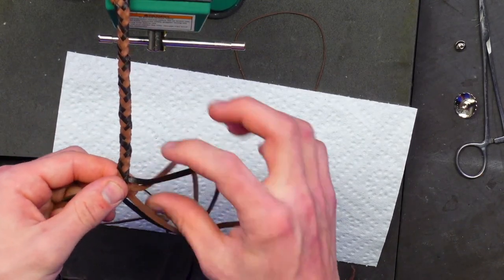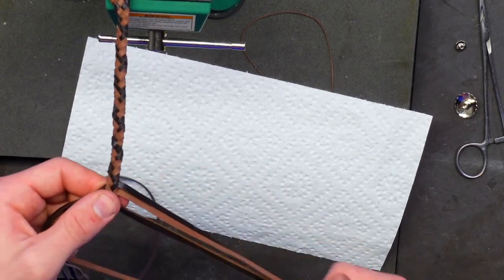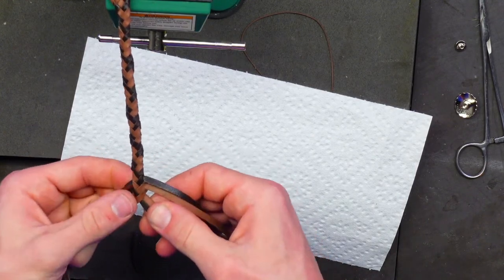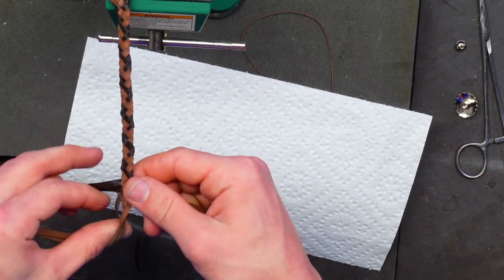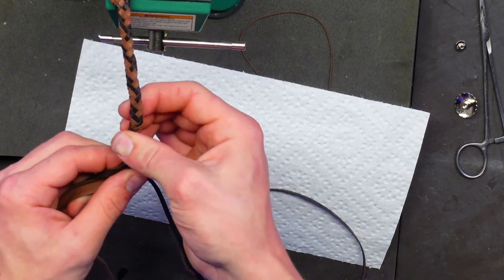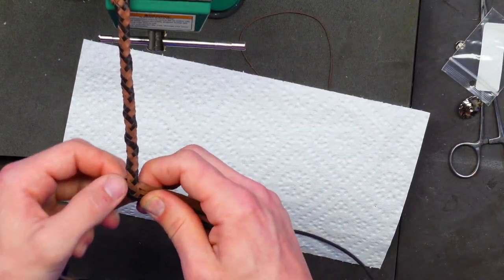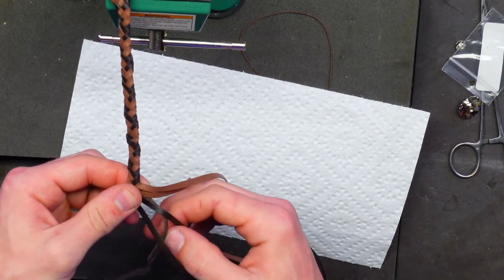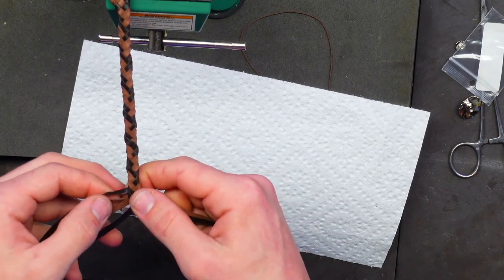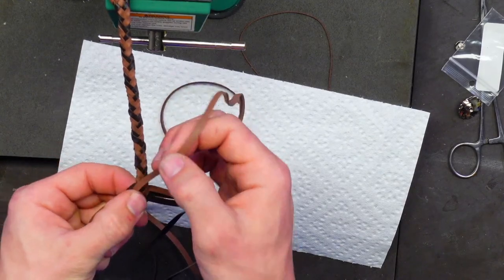When you use it as a resist, you can wipe it on a lot easier. It doesn't really make a big difference. But after you've got your resist on and you put your antique on, if you go over it with a wipe-on sealer, you will wash a lot of your antique back off with that wipe-on sealer. Whereas if you just spray it on, you don't have to touch it. Right. And everything stays just like it was. And it's very durable. Shoot, I've used it now since I started working here. Before that, I used wipe-on. Had poor luck with it.